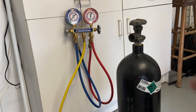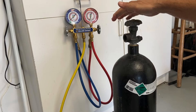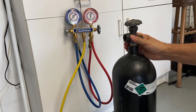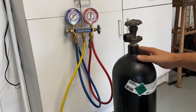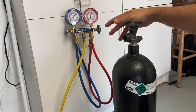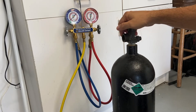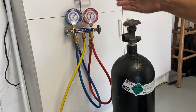Today I want to talk about nitrogen. This is a typical bottle you would keep on your service van and use when you are pressure checking a system — either trying to find an existing leak, or once you've done repairs on a system, you can put nitrogen into it and use it as a pressure gas to verify you don't have any leaks and that you're ready to evacuate and charge the system.